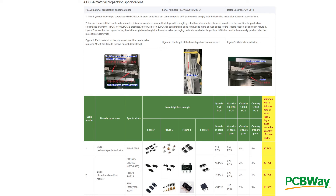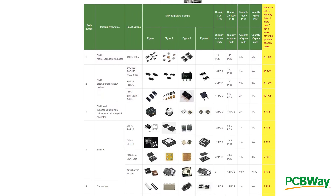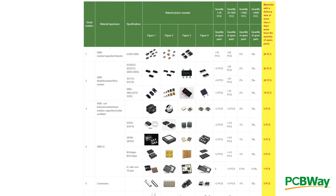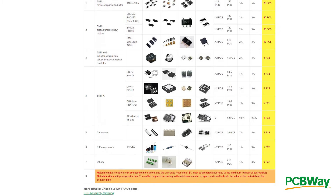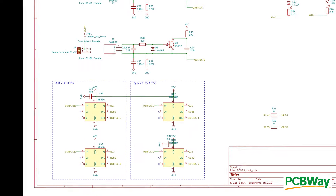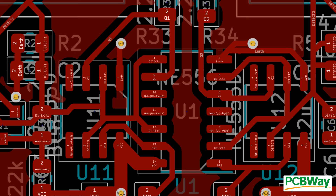There's also an inherent wastage in how the machine works. It needs a certain amount of reel before the first component and a certain amount after the last, purely for handling purposes. The components on that part of the reel are not used in the final product, but you still need to pay for them as that much reel is used in the manufacturing process. This makes using lots of the same component more efficient than fewer but more varied components. With surface mount 556s proving difficult and expensive to get, we adapted the design to allow eight 555s to be used instead. We preserved the pads for both assembly options for future flexibility, though.